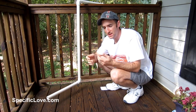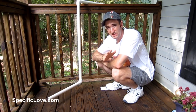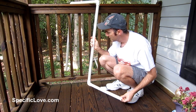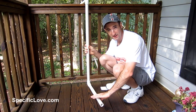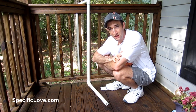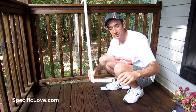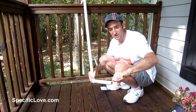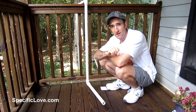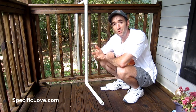If by chance you have a large tank at your house — maybe a fish tank, a pool, or a hot tub — at some point you're going to need to drain that, whether it's just to refresh your water or drain it for winter. Here's a great idea using PVC. You want your drain side to be a little bit longer than the suction side on your tank. Viewer Terry Dougherty's idea: take your shop vac, hook it up to this side of the pipe, and give it just a few seconds to start the flow of water. Once the water has started flowing, take the shop vac away and gravity will do the work and drain the tank.